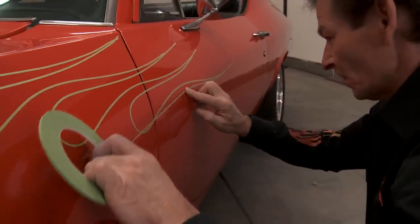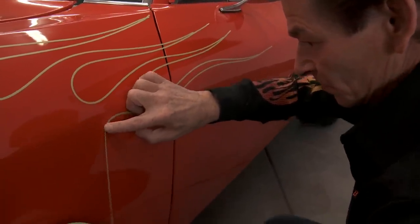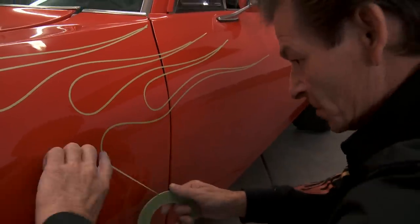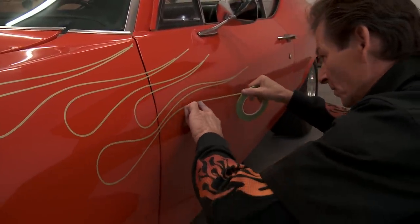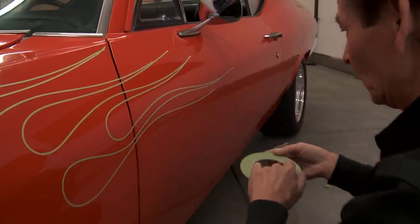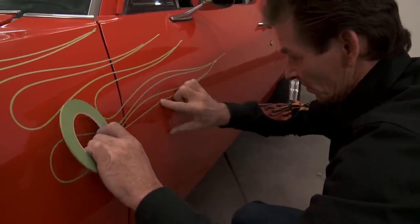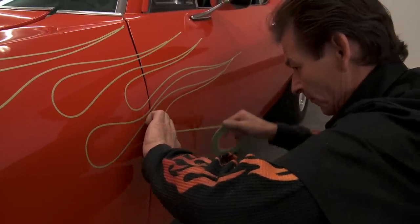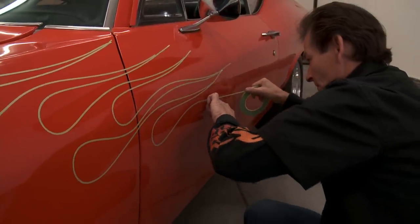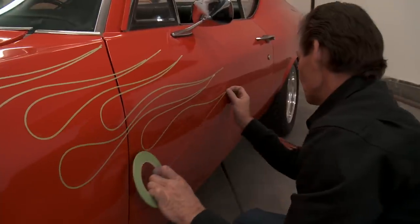I'm going to get to the whip so I can pull out a little further and make a nice flow. Start off nice and straight, follow the whip around the apex with a nice smooth round transition, flowing back through the tip again — then picking it up, going the other direction. This will take a little bit of practice, but as you get going, your first flame and your last flame will transition, and you'll get better and better each time.